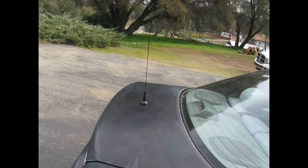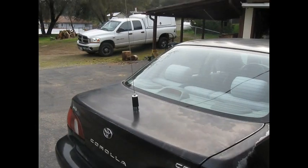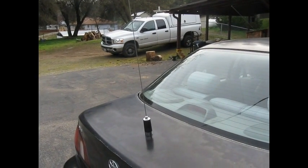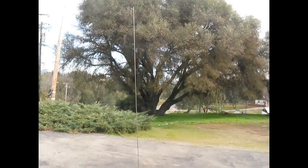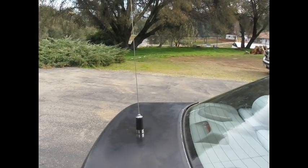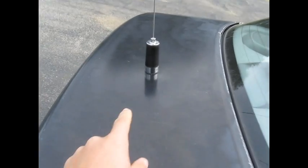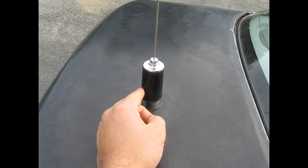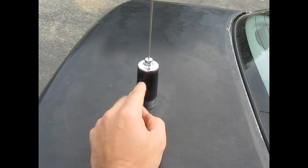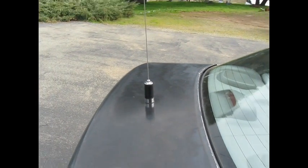But let's say you're in flatlands with no repeaters or mountainous areas — what you could use is this five-eighths wave antenna. This will be quite longer; this one measures roughly 54 to 58 inches. This length doesn't present 50 ohms to the radio if it's just a wire, so that's why you see a transformer built in here with some coils to match the impedance of the antenna to your radio. You need this antenna matching element for it to work efficiently.